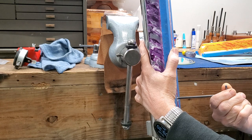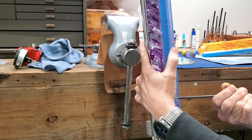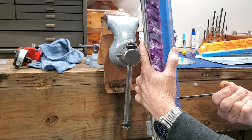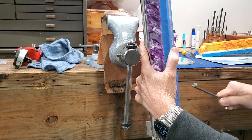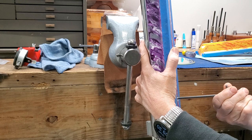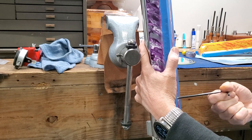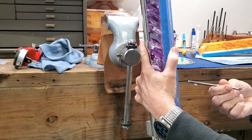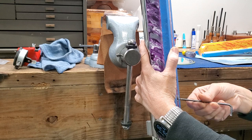Exactly the same. When I snap this loose, it should pop and come loose instantly. And then it should spin out freely, no cranking it like you would that wood screw to get it out. If you're doing that, you're releasing stress that's in the bedding. Now, see how that popped? And as soon as it popped, look, see how loose that thing is?